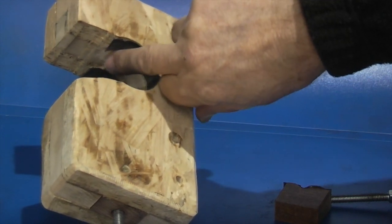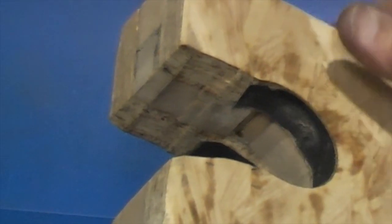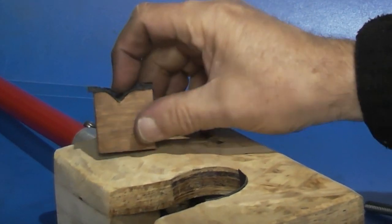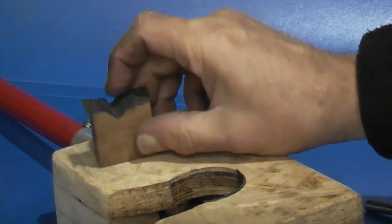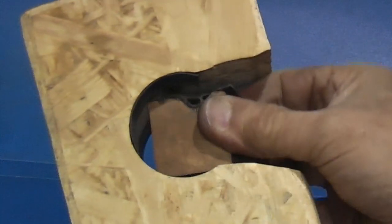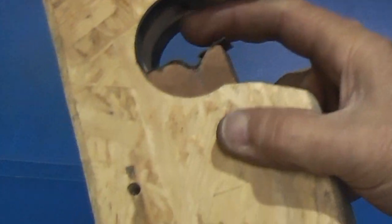You can see this is undercut here. The black areas are thin layers of rubber bonded to the wood to prevent the wood slipping. In the part at the bottom, I've made this piece of wood with a V in it. It's important that the V is across the grain, otherwise when you clamp the pole into the block it will split the wood. That goes in there, that way around, and will drop down the channel inside.